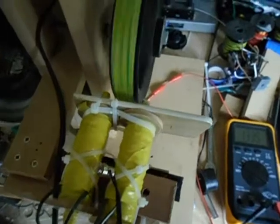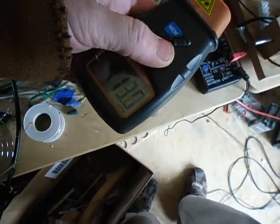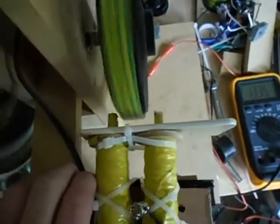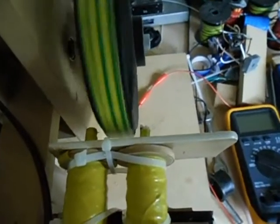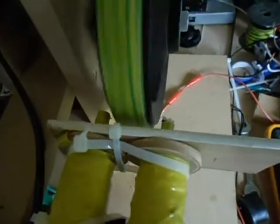I have to do some concessions. We will see if it gets a little out of balance or something, but I think because there are so many magnets it won't be much of a problem. Now the test. The ring is on. It is spinning very fast — only 80, I believe 70 milliamps, and over 400 RPM with both PMSs. The coils are connected but there is absolutely nothing — no lamp is going on. So the magnetic field is not strong enough, or it is changing too fast. Whether the magnets are too small and changing too fast from north to south — anyway, it doesn't work.